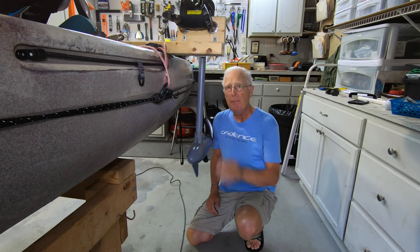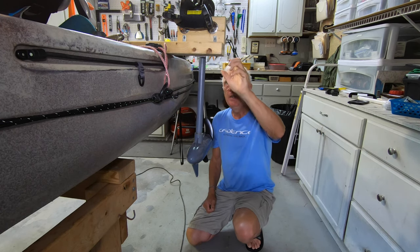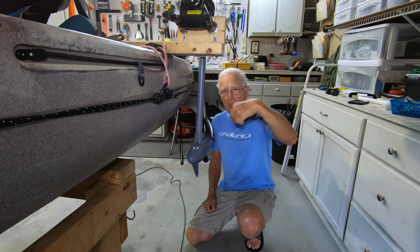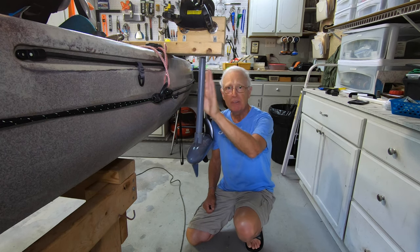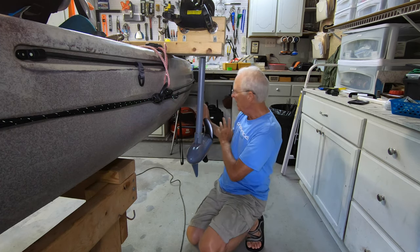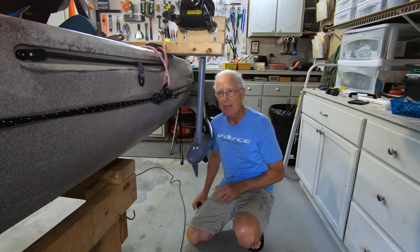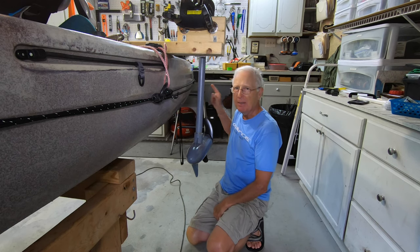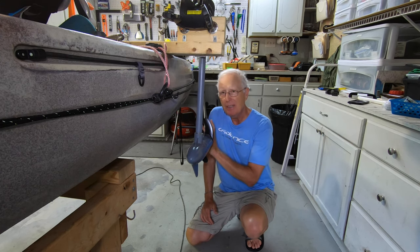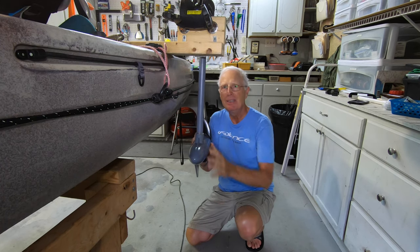I want to be able to lower it to get it farther into the water. The second thing is, this is up at the middle of the boat. I use my steering controls, so I don't need to touch the handle to change direction, and since I'm operating using the pulse width modulator, I don't need to touch the handle to change speed either. The issue with having it at the middle of the boat is the thrust of the motor is quite a long ways away from the rudder — 21 inches away. I've discovered that is really not responsive. Not only does the water take a long time to get going over the rudder, it's not responsive when you're pushing against the middle of the boat to get it to move.